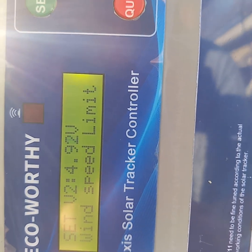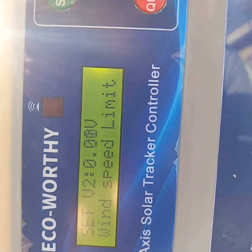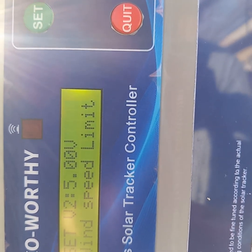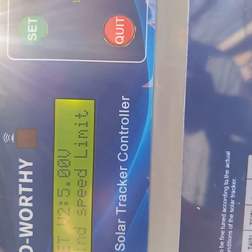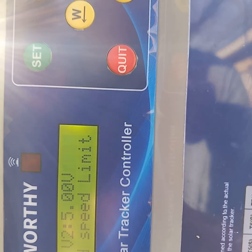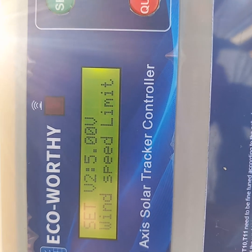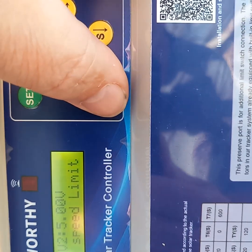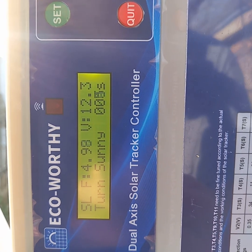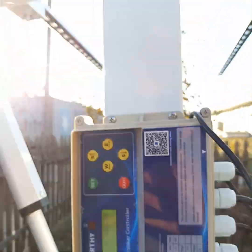If I go in here and raise it — it only goes to five, that is the max. I was lucky. As you can see, it restarts. I wish I would have known that before I spent 10 minutes climbing to five volts — that would have saved a lot of time. You can actually go backwards and back into five should you have this problem. But I do recommend you do not use this with panels in this condition. I luckily have just a hundredth of a volt to work with, so it will go ahead and start working. I'll save it, and now it is getting ready to go — since it is above 4.99, it's going to start tracking the sun.